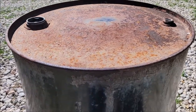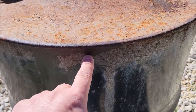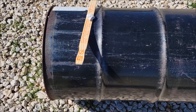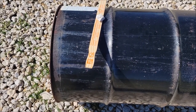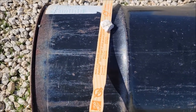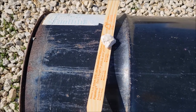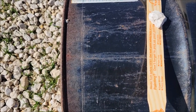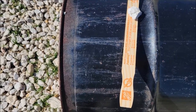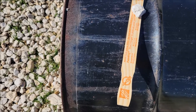The first thing I'm going to do is make a line going all the way around this thing about two inches down so I have enough lip to make a real lid. To make this line I laid the barrel on its side — make sure you're cutting the top off, not the bottom. The top is where the bungholes are. I used a paint stir as a spacer and a rock as a marker, rolled the barrel while marking it. That line doesn't have to be perfect — it just needs to be even so the lid lays on properly.